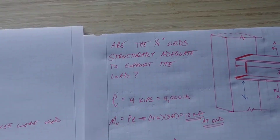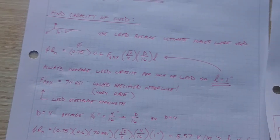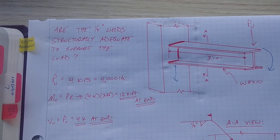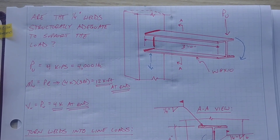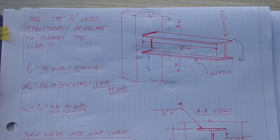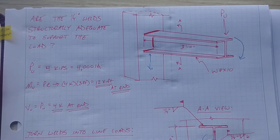We can now compare: our bending demand of 4.5 kip per inch and our shear demand of 0.67 kip per inch are both less than the weld capacity of 5.57 kips per inch. So we are okay — the quarter-inch welds are structurally adequate. This is a good starting point; there are more complex scenarios involving twisting or other forces, but today's example gives you confidence to start sizing and calling out welds in your designs. Leave any questions in the comments below, and I'll see you guys next time.